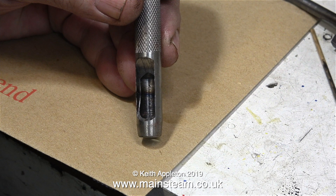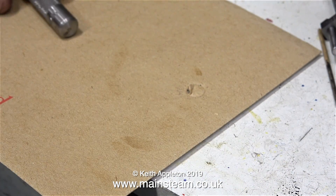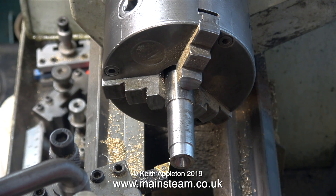Time to make some gaskets. I'm going to use some brown paper for the gaskets. The best way to make the gaskets is to punch out the centre part first. This is one of a set of hole punchers I bought via eBay, and I must say that they really are terrible — they don't even punch the holes, so they're a complete waste of time. And quite apart from being rubbish, they're too small anyway for the job.